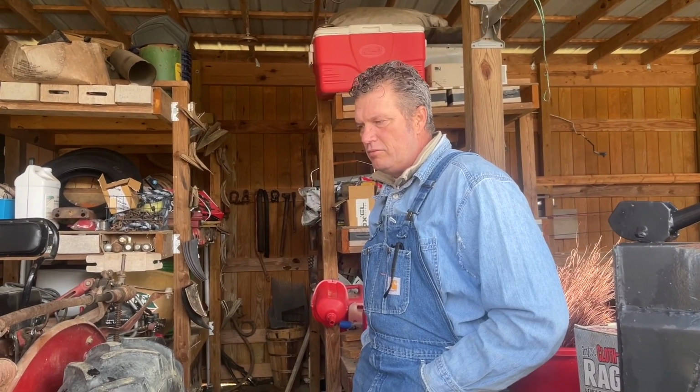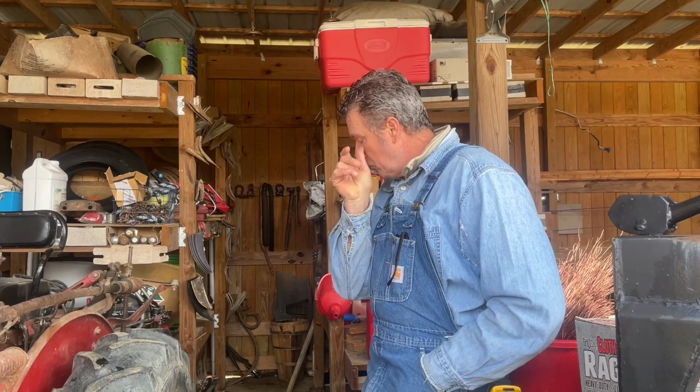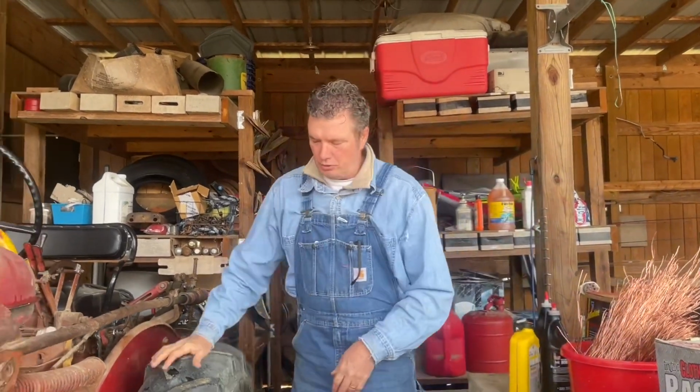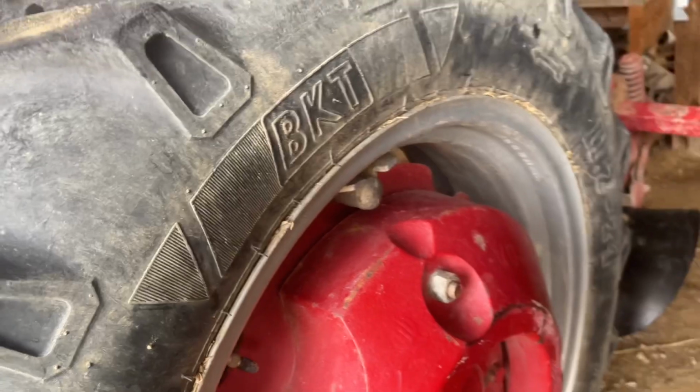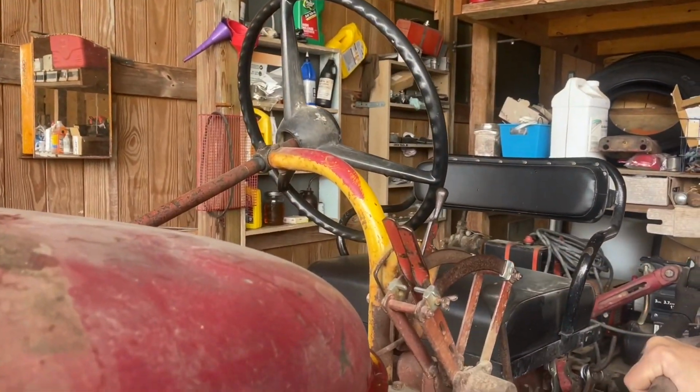But let's take this out there. We'll see what it does. And again, you know, we'll record something this winter. I know it's not a whole lot of content, but we'll get these tires off. I got to figure out how. Well, I do know how I'm going to do it. I'm actually going to undo them from the carriage head bolts here and pull the rim off this way. And can't wait to get them new tires on there. That's really a blessing. And man, I want to see what it does with that chisel plow. I might even have to let the guide wheels up a little bit on the chisel plow. The traction won't help that horsepower, but I look forward to it. And I'll wire brush those front rims real good and paint them red. And the biggest thing this fall, I want to get this dash done. So hopefully we'll get that dash done and have her all up and ready.